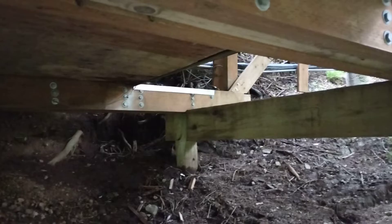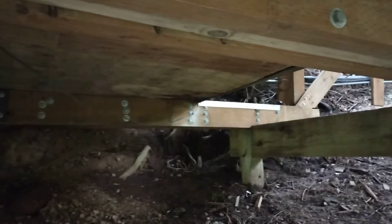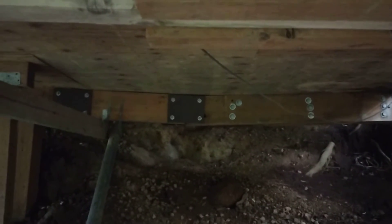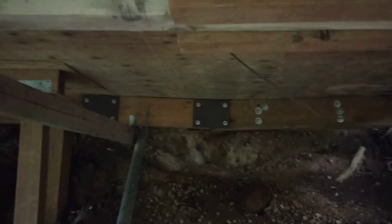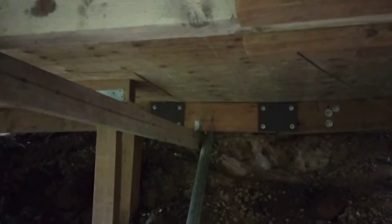Now let's take a look at this. The corner of the house is held up by that pier right there. There's the sister coming along — what's that? That's a splice. You can see there's a deviation from that splice and there's no support under that splice. It's only those plates. Then you come over here — this is a joist hanging off of the splice.